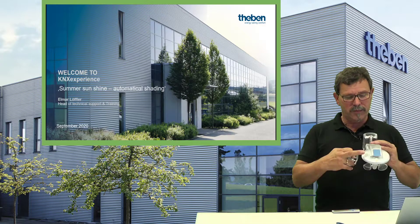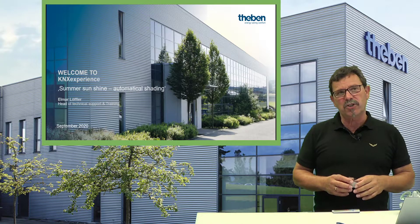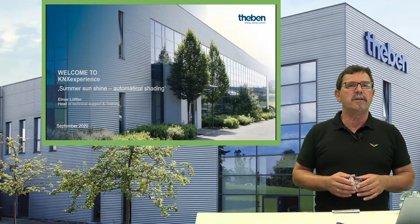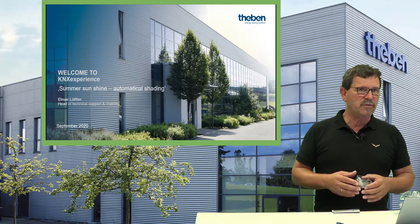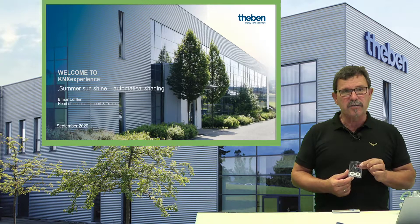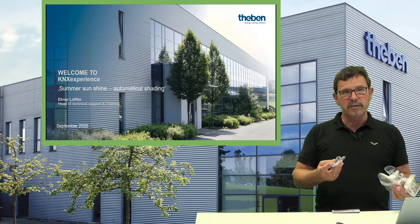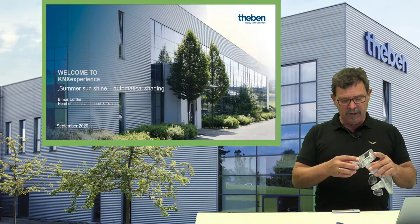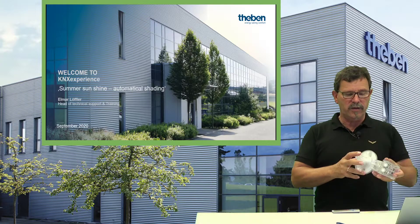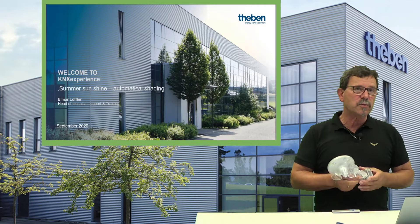We have two installation compartments. One is 24V DC — this is for the heating of the rain panel here, the blue one — especially required when you install such a weather station in colder areas with strong winters. With this heating you keep the rain panel clean for a good function. The other compartment has bus terminals to power the weather station and communicate on the bus. Once wiring is done, you slip the weather station over the socket, lock it with an audible click, and fix it with a screw below.